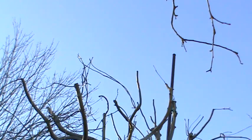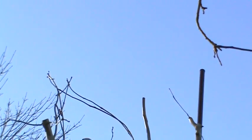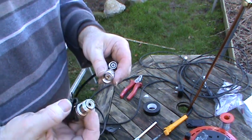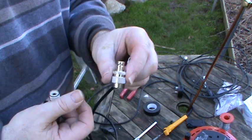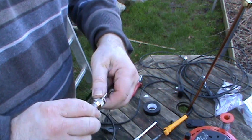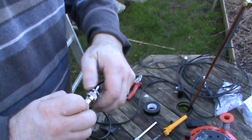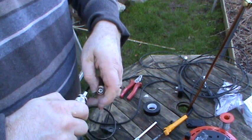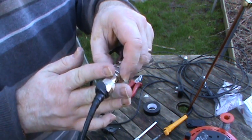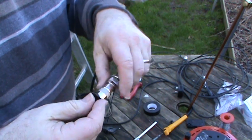The height to the top of the Miniwip I just measured as 760 centimetres. I'm now connecting the new and old coax, and for this I'm using a BNC to PL259 adapter. I'll use this area to connect to the ground rod and then insulate everything up once it's done.